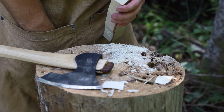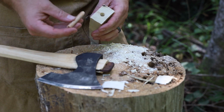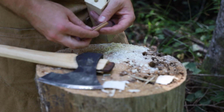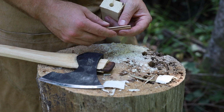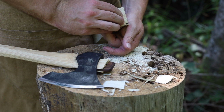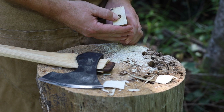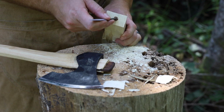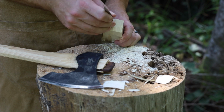And I'm going to start offering these split dowels with all of my blades that I have on my website. I find it just to be a really easy way to fit a blade without having to cut a slot or do any burning in of the tang. You just have the split dowel and it creates the slot you need within that 3/8 hole.